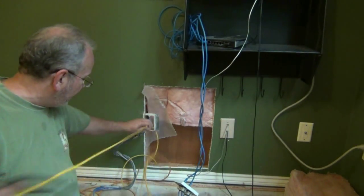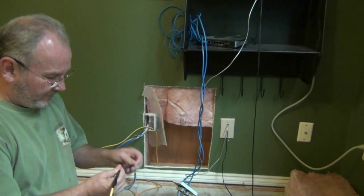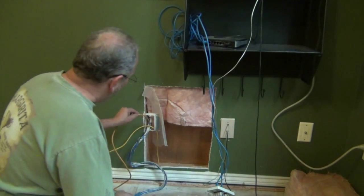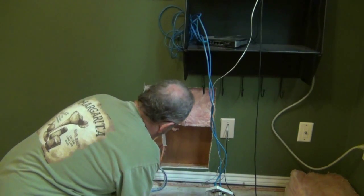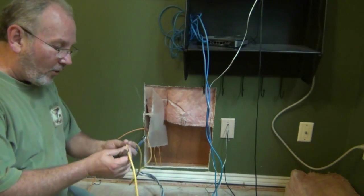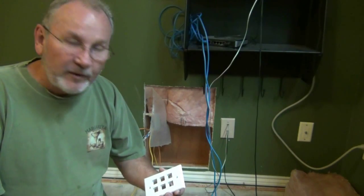You can see here's where I have the two wires together. If possible, I'll just feed this orange line back through; otherwise I'll tape a little bit and pull it back through to get my orange line back down. I'm going to have to go under the house one last time once I set up a hole and get things set up for the other spot in the house that I'm wiring. When doing these types of jobs, you always want to leave some extra line that can push into the wall in case you ever have to re-put a new connection on or redo something — you've always got extra line to play with.